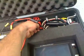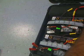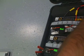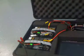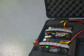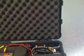You can also take out the batteries individually and charge them on their own just by disconnecting that cable, so that only the battery currently connected is being charged and the other one can be used to power the system. But if you are charging the batteries in that mode, I recommend that you take the battery you're charging out of the enclosure to prevent any confusion or inadvertent power-on of the system while charging, as that may likely kill your camera — well, we don't really know that for sure, but who wants to find out?